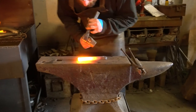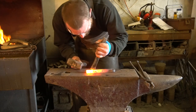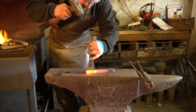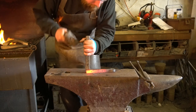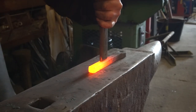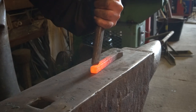My bar's nice and hot. I'm going to take my hot chisel and support it on my hammer so I can get it right. Nice and gently to start with — make sure it's in the groove. Always work at a slight angle, gently to start with, get that line where it needs to be, work my way down to the outside edge. On the next heat I'm going to spin around and do the same on the other side, using my hammer to support the work, into my centre punch to start with, and then using the groove that I've already cut — overlapping by halfway — working my way down the bar until I get to the end.